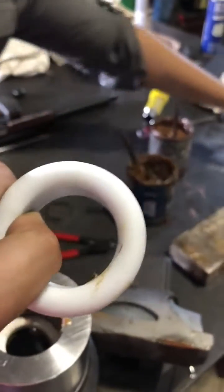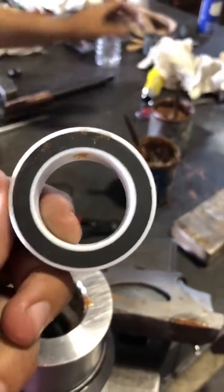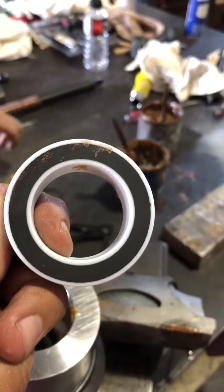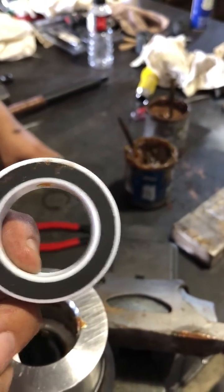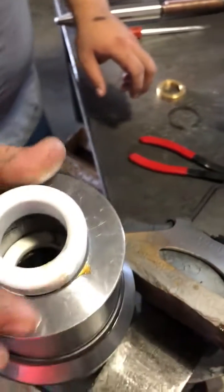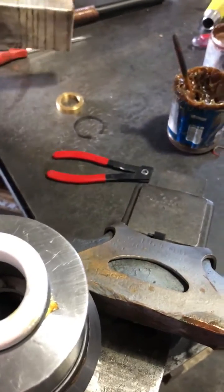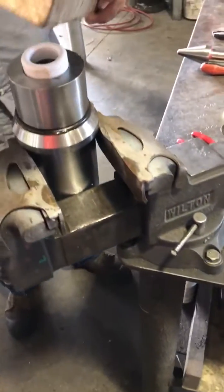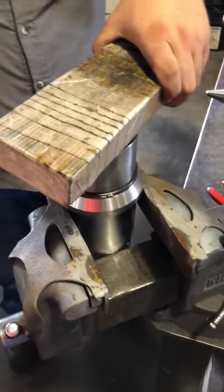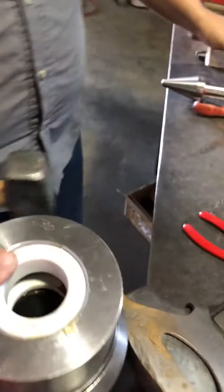It's going to be a U-packing, so it's rounded on the top and flat on the bottom. You'll notice the flat part has the Viton in the middle with the Teflon on the outside. You're going to have it so the black part goes down towards the hand wheel, and the curved part is actually facing the pressure. Using a piece of wood is the easiest way to get the packing down in there.